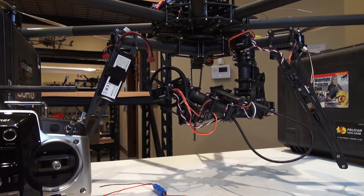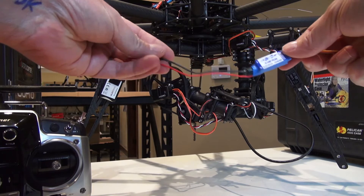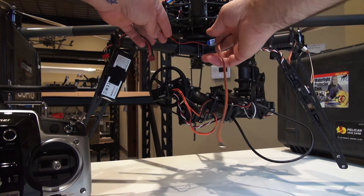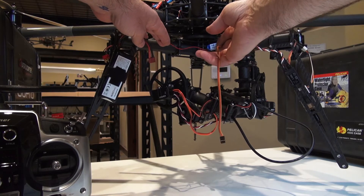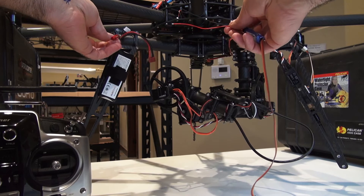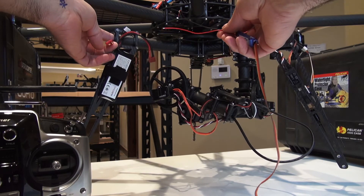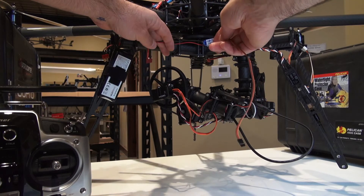Now for the Radians, the HDMI to SD converter, and the servos, we need 5 to 6 volts. So we're going to use one of these Castle BECs — these battery eliminator circuits — and we actually tuck that inside the carbon boom. You can't actually see it, but imagine the BEC is inside that boom, and we're pulling the 12 volts off of our 3S LiPo. That Y's into the BEC, so 12 volts in through these wires.